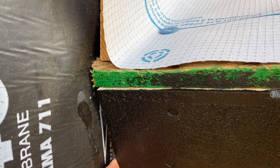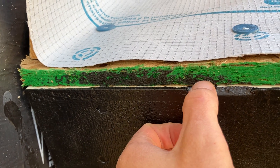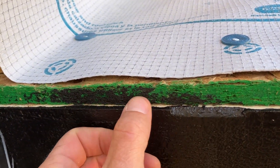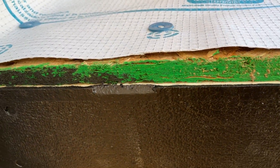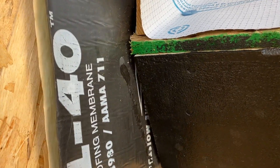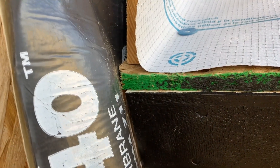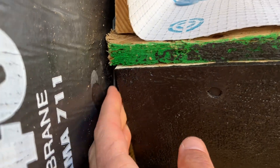If you're putting gutters on, you'll end up having a gutter here that slides up underneath this drip metal, and then it'll dump right into your gutter. Really important detail — to make sure this happens, make sure you hold this fascia back. Get this peel-and-stick membrane in here before you end up putting any of this on. Make sure before your Z-bar backing, everything goes on, and get it tuned up.